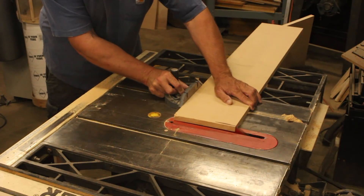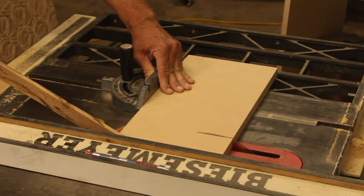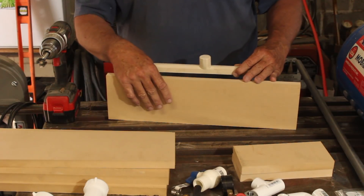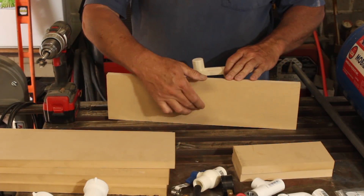The box is going to need a hole where the vacuum will be drawn out, and it's also going to need inlet holes. We want to drill all those holes first so as not to put all the debris from drilling into the vacuum system. This is going to be the side, and my interface is half-inch PVC — we'll just put one hole in the side here.